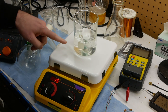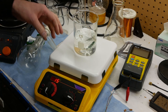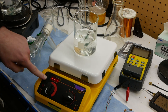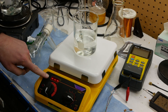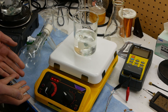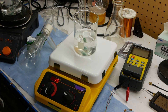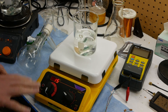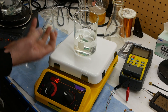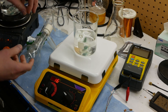So if you speed up a stir plate, it stirs faster and faster until the bar launches off because we've lost traction — it can't spin that fast. With our method, the machine now knows that it's not in radio contact with the bar, and you can program the machine to automatically slow back down and catch the bar again. And now that it's lined up again, it's reading out. We're going to do a teardown a little later, and the read range and concentricity of the coils — the transmit coil and the tag coil — have to be pretty good.